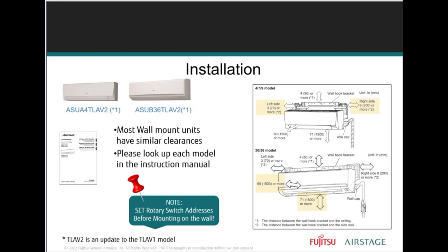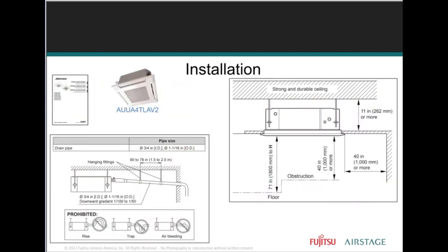The importance of this is manually setting these switches on the system before you mount that indoor unit in place, so you don't have to get back on the ladder, go back up there, disassemble the unit, get into the control board, and get to the rotary switches and the dip switches. Do it while you still have it on the ground, and it's easier to work on. Just a tidbit of information, and we want you to do that with all of the Fujitsu equipment. Before you put it in place,